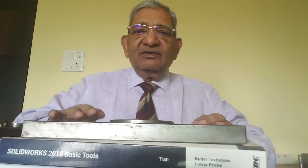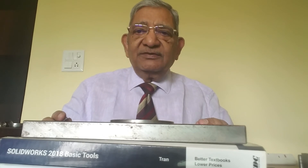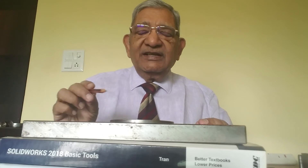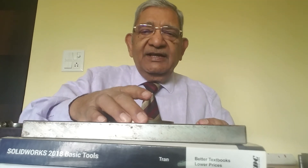Now we will discuss the material. The material of this front plate is C45, 1.1730, or EN8. The material of the locating ring is also the same — C45, 1.1730, or EN8. Both are not hardened.